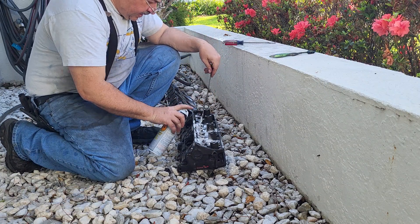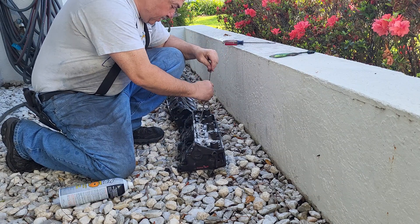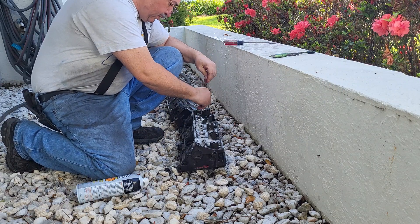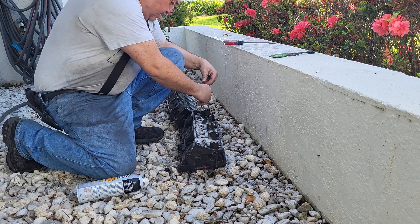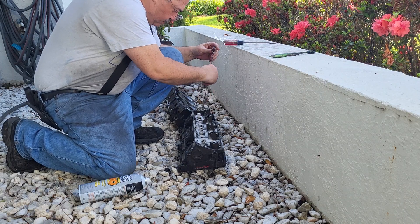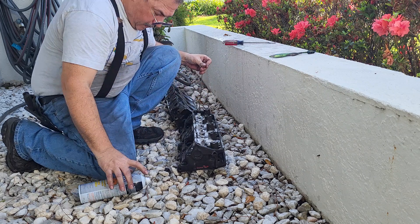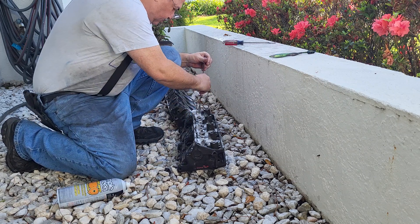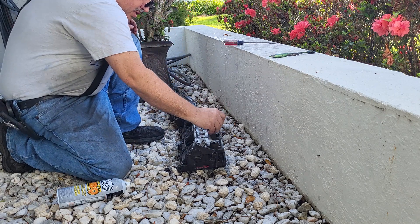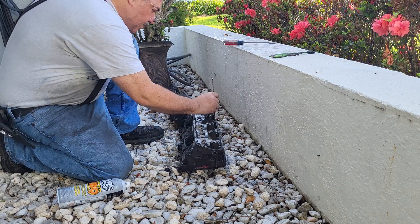Right after you're done you've got to hit them with the air compressor and a nozzle — blow every nook and cranny out — and in a lot of cases you may be doing this more than once. Now this is not the final cleaning; they're only going to get cleaned once more. I probably should just finish this one head and call it a day on this video. Also clean where the push rods go, and the bolt holes — I usually tap all my bolt holes to make them clean.